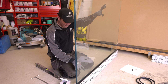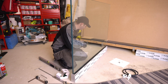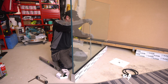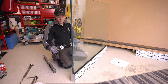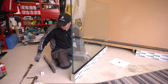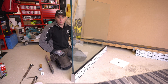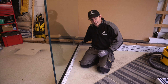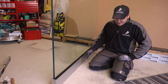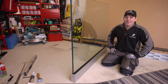When you look down into the track on the wedge system you can see a little white arrow showing where the glass wedge needs to go — they basically drop straight in. Then with the knocking tool on top, give it a firm hit. Last but certainly not least is the inside finishing gasket, labelled D — this pushes in on one end and with a gasket roller rolls nice and neat into place. Last thing to do is pull off the protective film, which is another great benefit of On-Level products. Once the film's off it reveals the finish of the product — the gaskets inside look really nice and neat, and the design and finish of the product is brilliant. I can't recommend this one enough. Thanks for watching and we'll catch you on the next one.